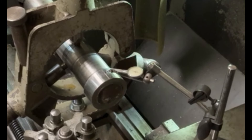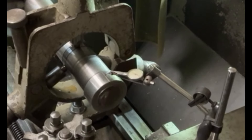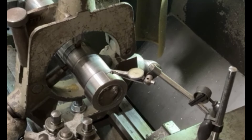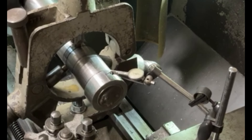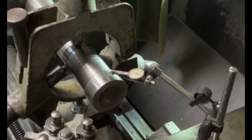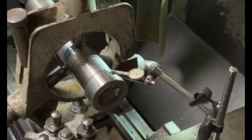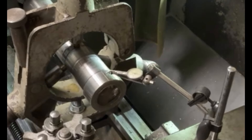I've got this shaft mounted in the lathe chuck and running through the centre steady. I've got a clock gauge on it so that I can centralise it pretty well, perfectly in the middle. It's a bit difficult to see the clock gauge from this angle, but it's running within a thousandths of an inch — so it's pretty close. I'll just keep winding it by hand. Once I've got this set up properly, I can start machining the end of it to take the cone end.